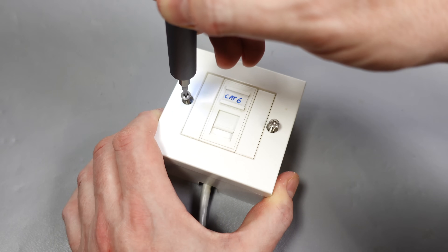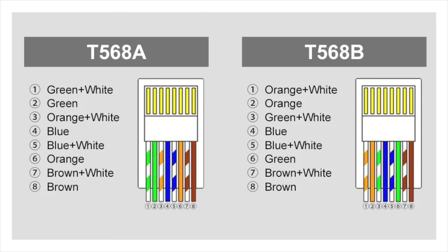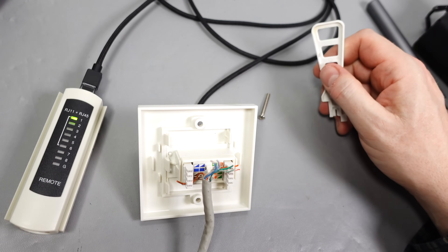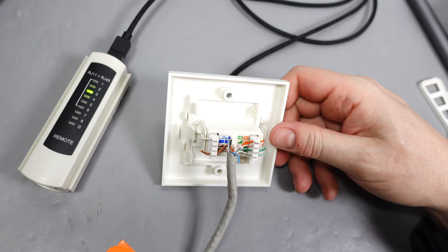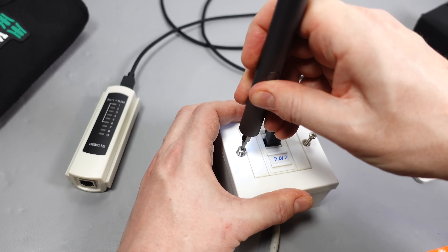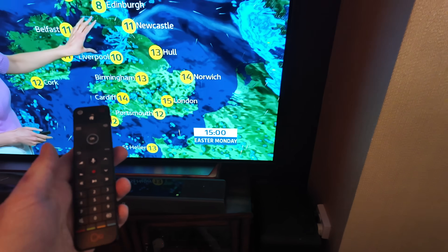What happened is I connected the two junction boxes based on the colour-coded key printed inside each one, but on one I'd used the A standard layout and on the other the B standard. So it was just a matter of unpicking the wires and starting again — this time moving the box from layout A to B. As I connected the wires back up, the lights started flashing sequentially, and by the time I finished all lights were showing good connections. With the boxes reassembled, both lights on the receiver were illuminated, showing it was communicating properly with the transmitter and the TV signal was being received.